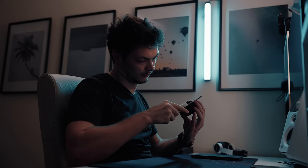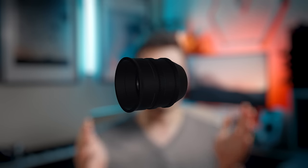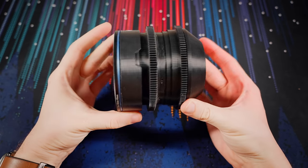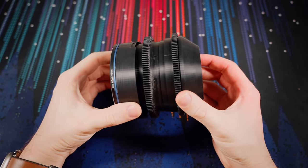Fundamentally it's not that hard — you measure the important parts of a lens, you base your design around those measurements such that everything fits and makes sense — except it's actually way harder than it sounds. This was my original 2D concept. I collected a bunch of popular cinema lenses to see how they're designed, what they have in common, how they work, and this is what I came up with. The prototype worked, but it wasn't very good — it looked very cheap and amateur with parts moving over each other, the gear design wasn't printing well, but it showed me that I could do it.